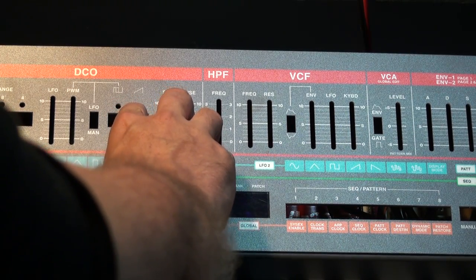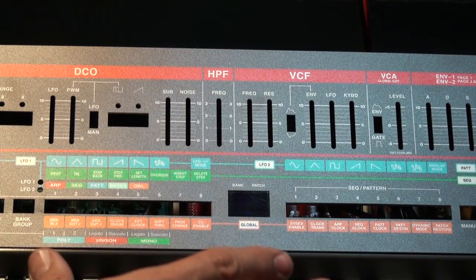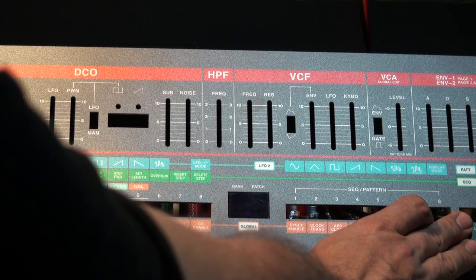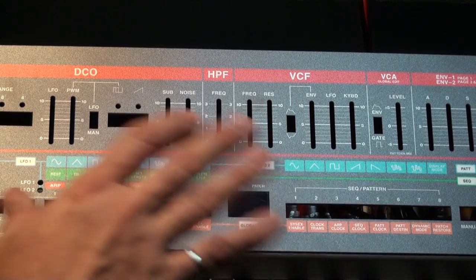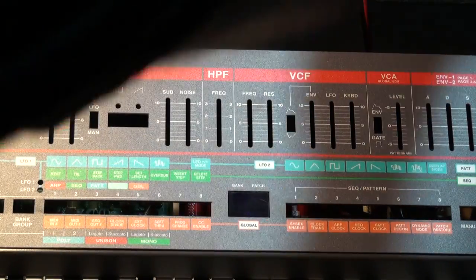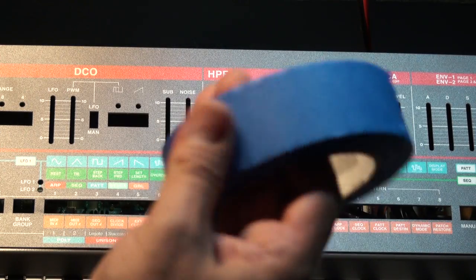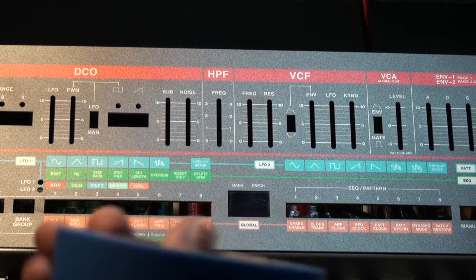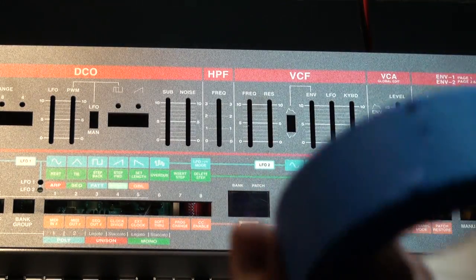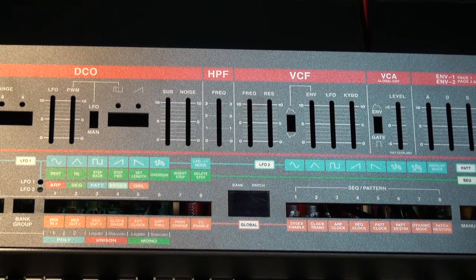catching all of the openings within a certain tolerance, but you will find with your individual synth front panel there are slight variances, and so what you want to do is compromise all of these hole slots and also the ones around the LEDs. Now, I have here a little trick taken from the Chroma Polaris panel membrane job, which I cover in redoing the panels for my Chroma Polaris in a different playlist, and it's painter's masking tape. So it's almost like it has post-it note style stickiness as opposed to the real deal.